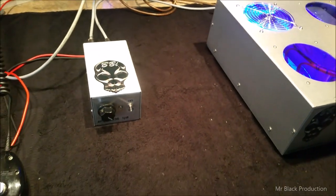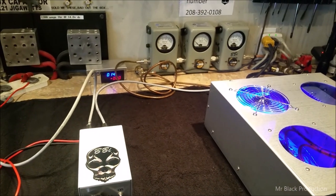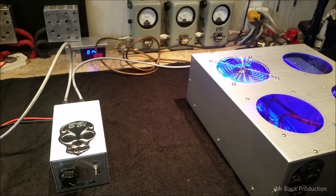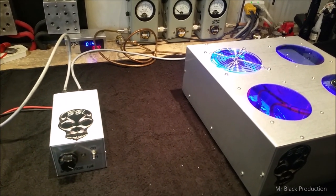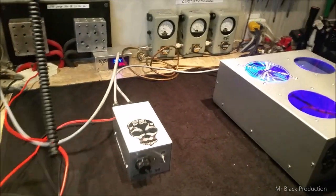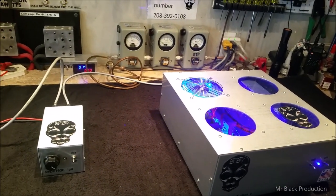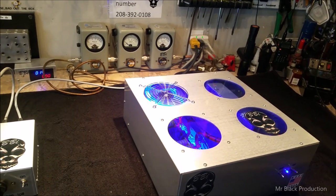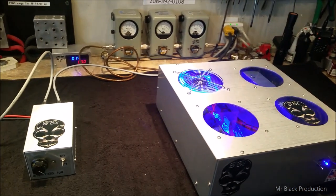There are certain amplifiers that are built where they've got coax on the inside of the unit. So the coax on the outside of the unit is hypersensitive to how the box is going to be tuned, at least at the metering point, which is usually the line section on the back of, like, a 32 or 64 pill. There's coax on the inside to carry the RF around. Let's just say Skullcracker, for example. Great box, built by good people, performed very well, was very tolerant to volts and put up with a lot of abuse. But a lot of people had a hard time getting it square in their head that the Skullcracker had coax on the inside of the amp.